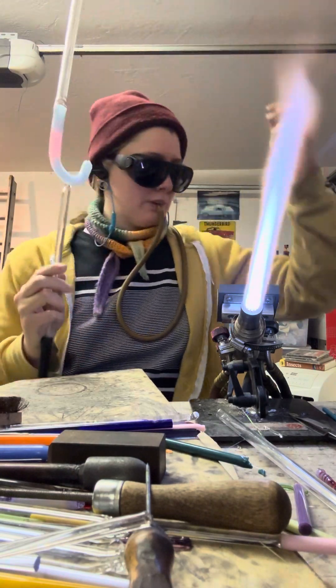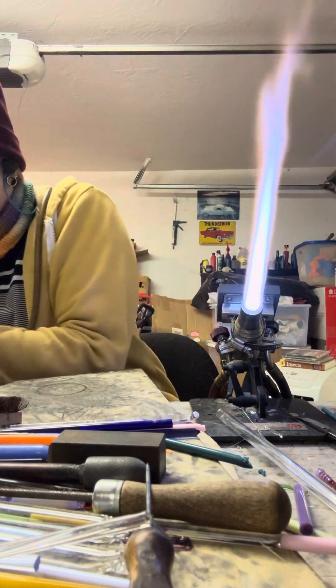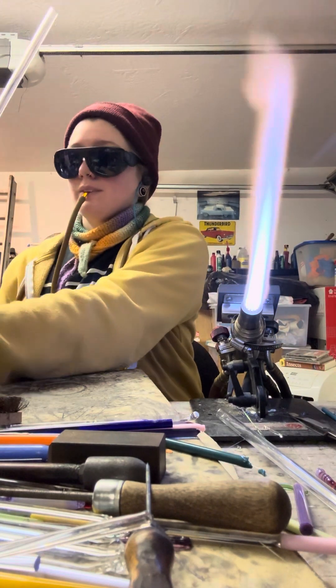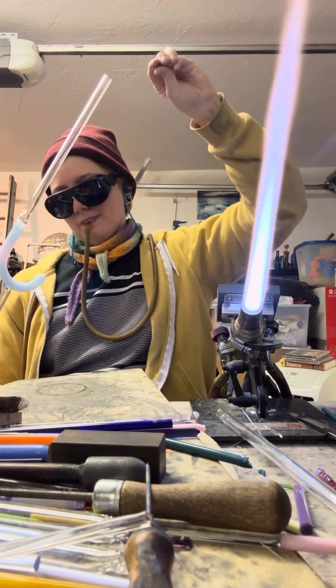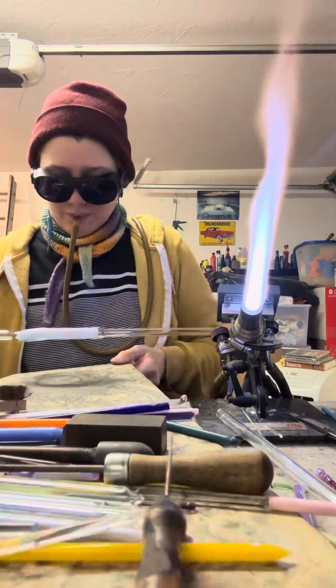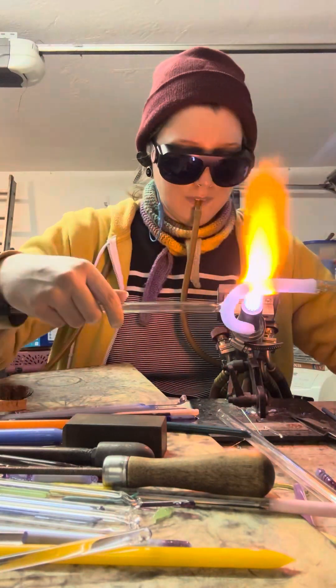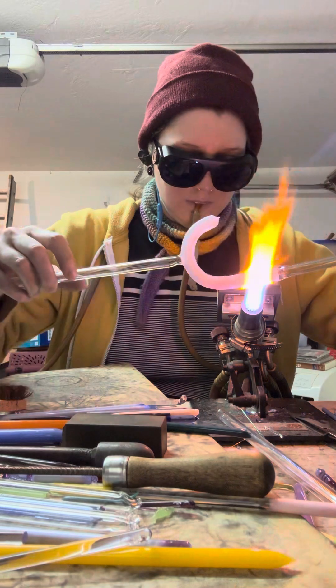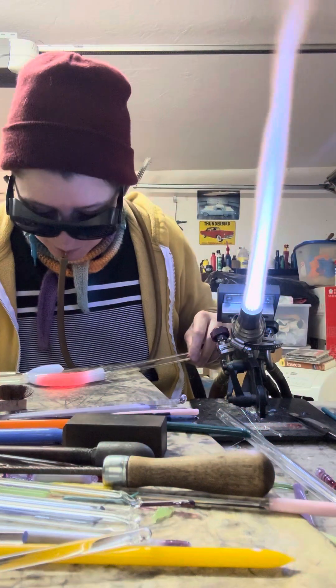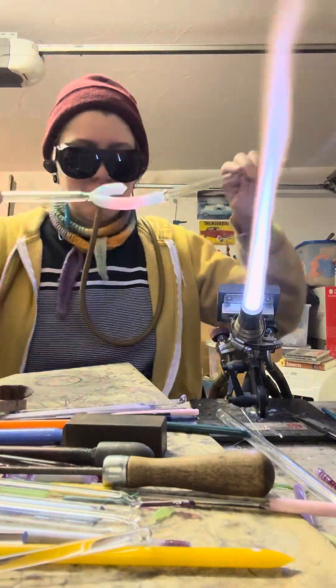At this point I realize I have no pressure in my tube because I left the other handle open. So I have a blow tube on one handle and I'm taking a foam ear plug and placing it in the other side of the open handle so I can keep pressure within my vessel. They're super cheap and very accessible — you can get hundreds of them for about ten dollars. I use them all the time; they are my favorite way to plug handles.